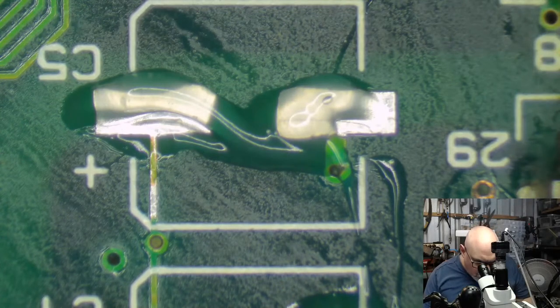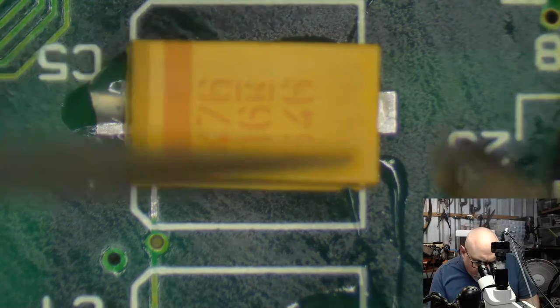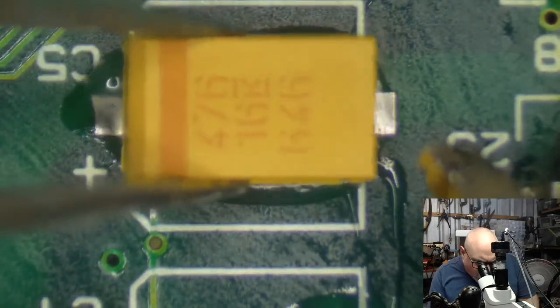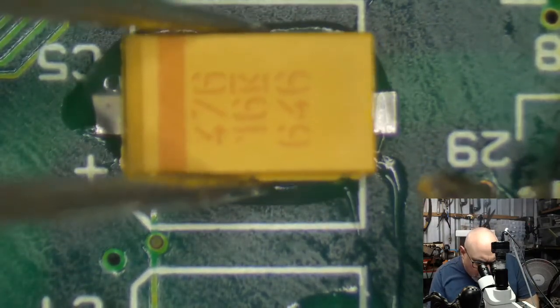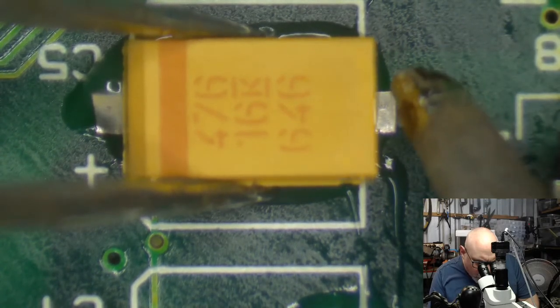I can't just go, oh, yeah, no, I reckon it's fine. If someone comes to me and says, look, I have serious concerns about this analog board, whether they are right or wrong, I can't just assume it's okay. I've got to have a look at it. And Color Classic analog boards do get capacitor leakage on a couple of them in particular, and I'm going to point those out when I get the board out.